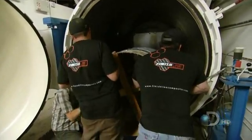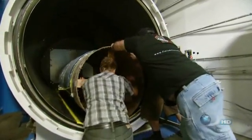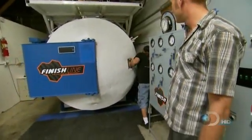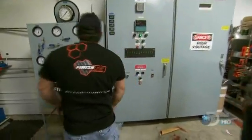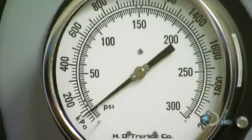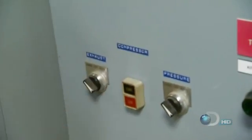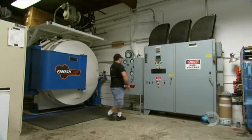The autoclave is a large oven designed to slowly heat and pressurize the stacks, forming them into a super-strong material sturdy enough to stand up to the pounding it will endure as the six legs of the all-terrain vehicle. The goal temperature is 250 degrees Fahrenheit, but like any good roasting, slow cooking is better — so the heat is set to rise one degree every ten minutes until it reaches the target temperature.